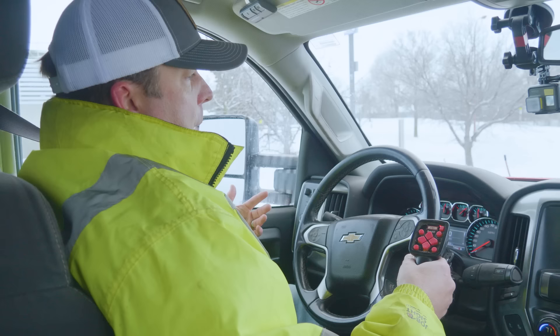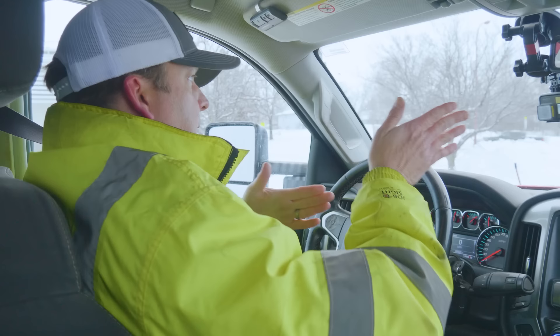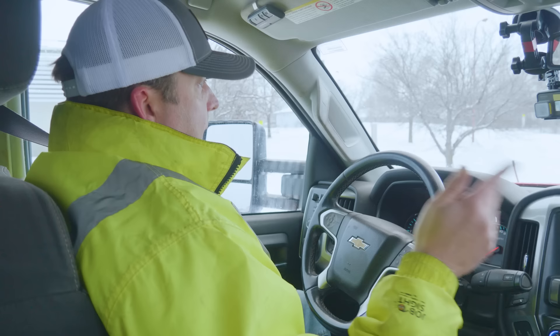Typically for a V plow like this and for any commercial lot, you're going to do a windrow — you figure out where the plan is, where all the snow goes. A windrow is basically when the blade is at an angle and you just keep pushing it over. The V is going to take material and just push it forward. When you're doing a windrow with that blade angle, you're going to keep pushing that material over to whatever direction you're going, trying to pull it away from any building or obstacle.